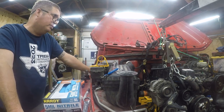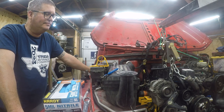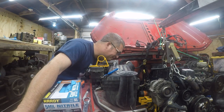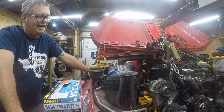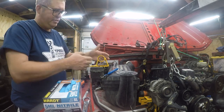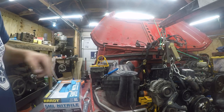Almost tempted just to weld the whole goddamn thing together and be done with it, but one day I might actually want to take this apart. Oh, it's all I can do not to just weld the whole thing together and call it a day. Oh, it'd be so easy to do. So anyway, I think I'm going to go ahead and go to the hassle of scabbing this. So I'm going to cut a piece of quarter inch material, the footprint of this, and it'll just bolt down in between it, and it just adds some rigidity to it so that this piece can't sag.